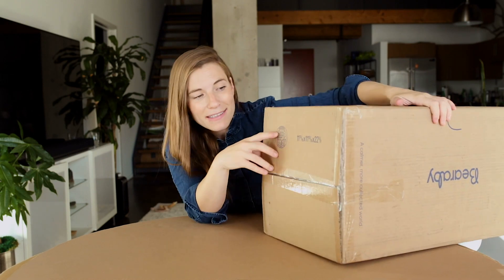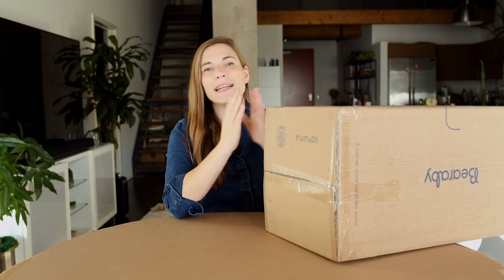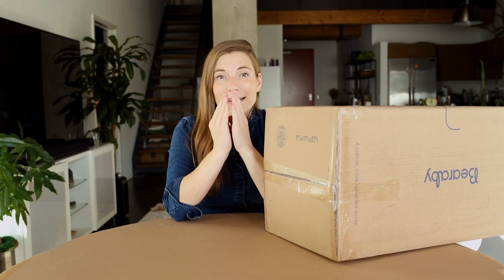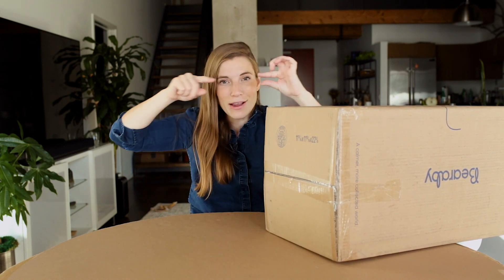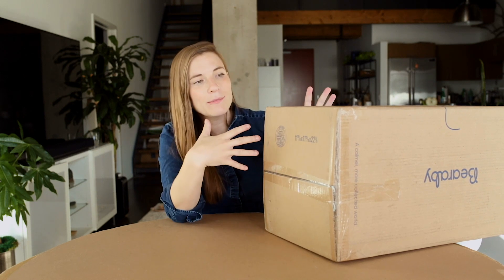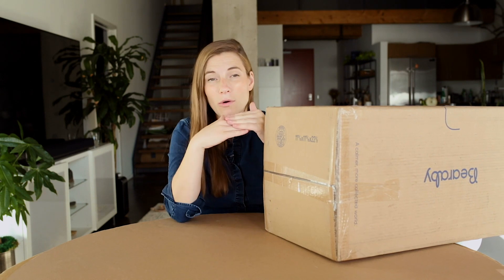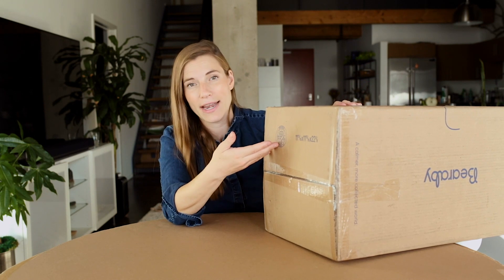One more call out: this box is actually double wall. Double wall means the box is two pieces of corrugated actually bonded together. So instead of one single piece of wavy corrugate, there are two pieces bonded together. When we open this box up we'll look at what those two layers are made of. Two pieces of corrugate bonded together means more strength, and that's probably how you get this 48 ECT rating.